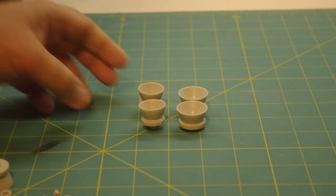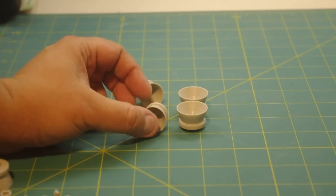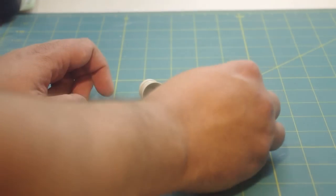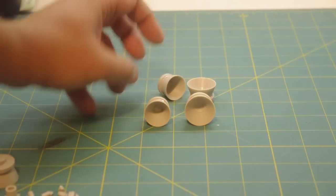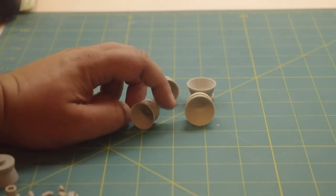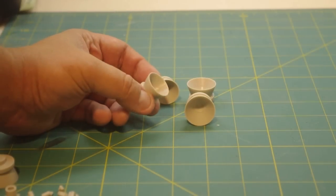But I was able to overcome it, and using my sanding papers and sanding sticks and flat edge rat tail files, I was able to come up with a nice set of engine bells, and believe me, it took a long time to get these done. I am very meticulous. You want to check your work, especially where natural metal finish comes into play. But the results speak well for how good the quality of the kit is.